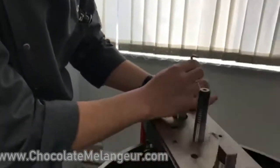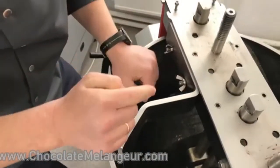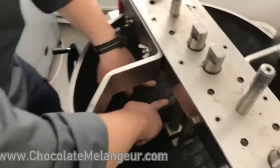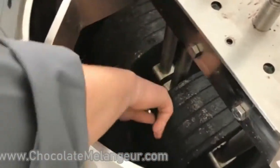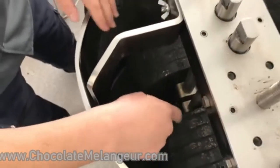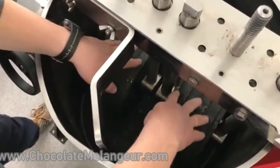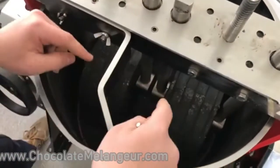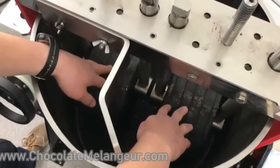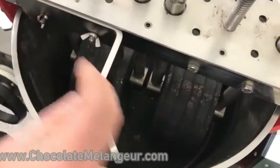But because the stones and bottom wear into each other, the most important thing now is to mark which is the left stone and which is the right stone. I will stick some paper on it. It is important to place it back in the same direction, because if it is swapped, it will take another month to wear in to each other.